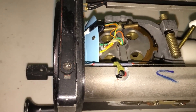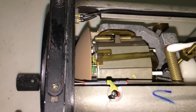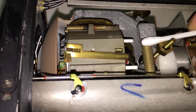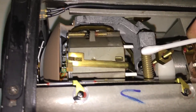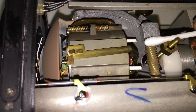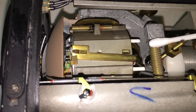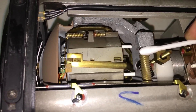So if we spin the gyroscope upside down, you can see that little brass tab. As I just rotate the gyro slightly left and right, you can see that under the normal weight that little brass arm is exposing the hole or blocking it. So that's actually one of the pendulous vanes and that's how the gyro operates to correct itself. I'll reposition the camera underneath looking straight up so you can see the pendulous vanes from underneath.